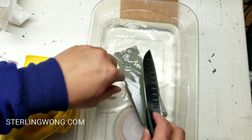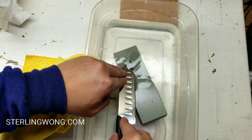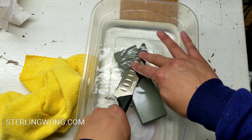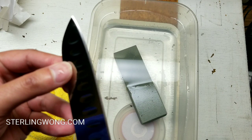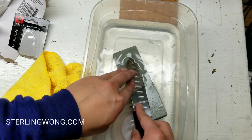I probably messed up the first time when I tried sharpening it — I got rid of the original factory edge. But after sharpening it for another 20 to 30 minutes and experimenting, I found this method of half-soaking the stone much more efficient in terms of getting all the metal that gets ground off floating into the water instead of just landing in the stone. I'm wiping out the metal that's accumulating on the blade and also checking the blade again. It's getting sharper and sharper.